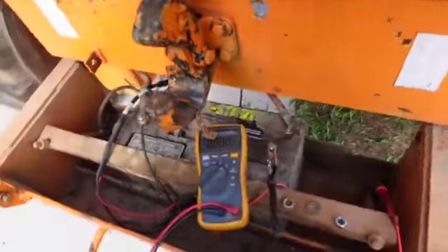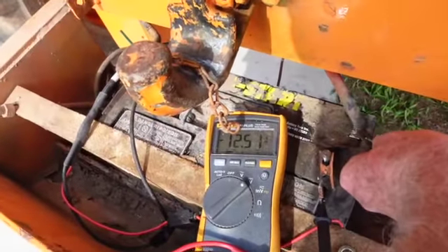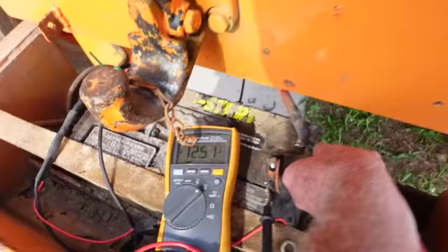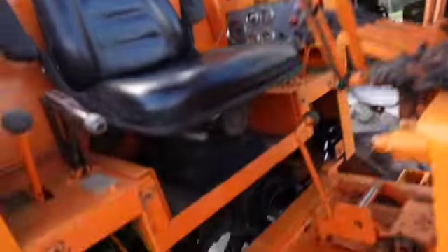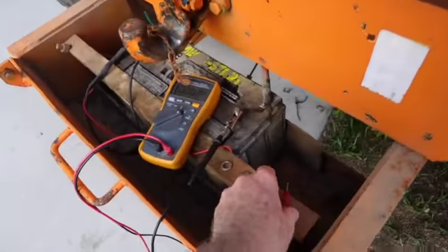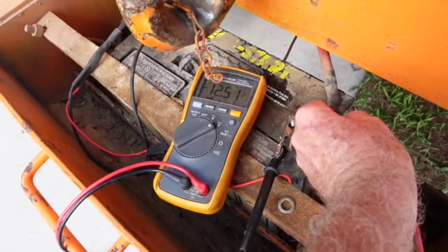I've already got the meter turned to voltage — we are showing 12 volts. I got it hooked up backwards but who cares, so 12.51 volts. I did notice the other day, and I mentioned it to Sean this morning, that this switch was on. Let's turn this switch off. I also found out this is an inverter that takes the system from 24 volts down to 12 volts, and that might be why we saw heat the other night.